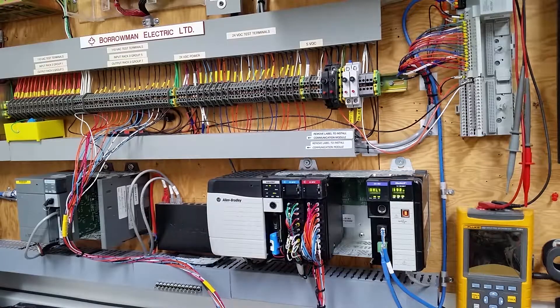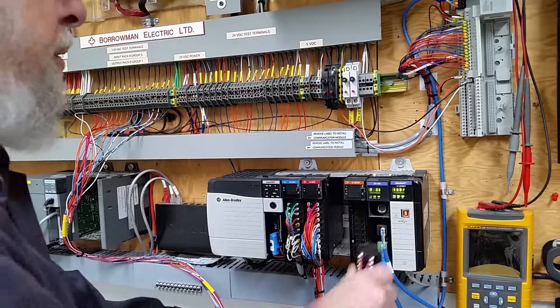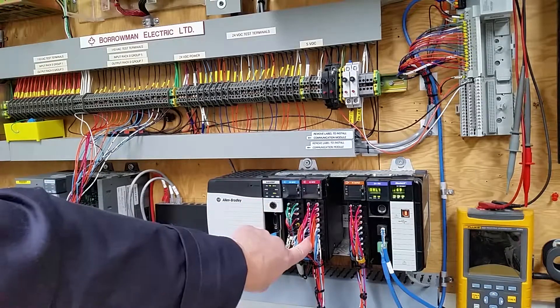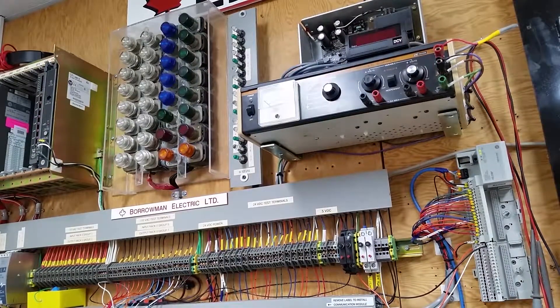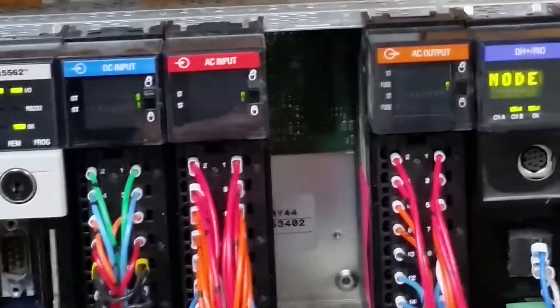So here we're back. Here's our standard chassis. Here's our OA16. Here's our IA16 that it's tied to. Insert it, install the wiring. What I've done is the outputs are parallel to an input card, and this cable goes up to the terminal strip and they're tied to these pilot lights. This gives simulation of a reasonable load that you're going to see in everyday industrial use. And I've got just a little test program set up.